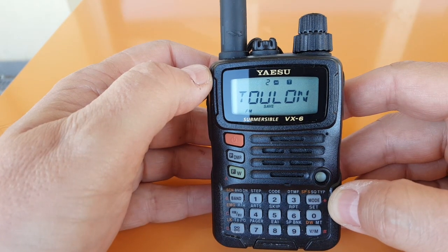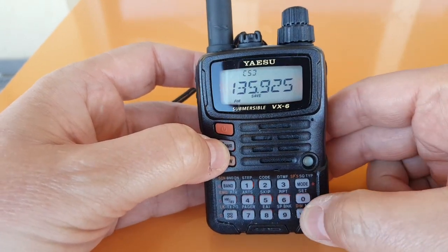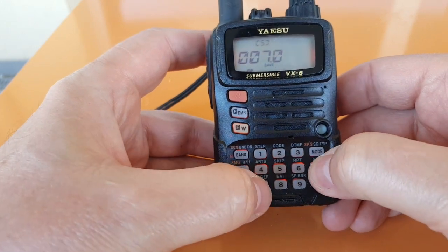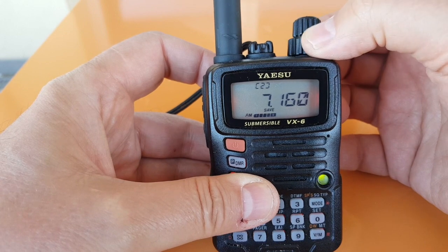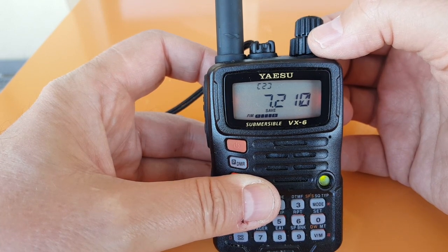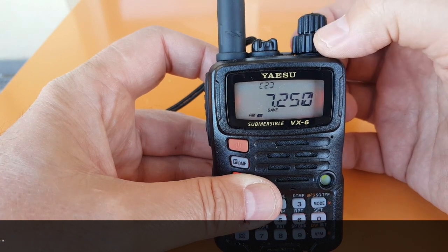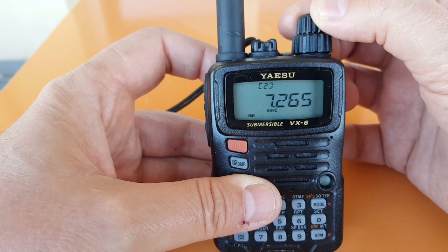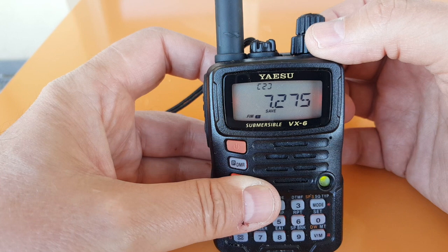Why is it so good for prepping? The main feature is the wideband receive — 500 kilohertz to about 900 megahertz — and that's a lot of frequencies. For example, I'm going to go to 135 megahertz and then change to 007, so here I am on 7 megahertz. I might even be able to find some broadcast AM stations. That's the 40 meter band and it is a broadcast AM station. You'll notice it steps in 5 kilohertz increments — here I am on 7265, I can only go to 7270, 7275 — I cannot go in between, and that's one of the big downfalls of this radio.